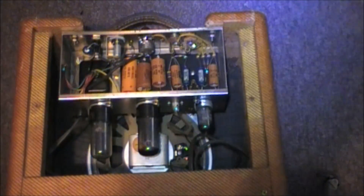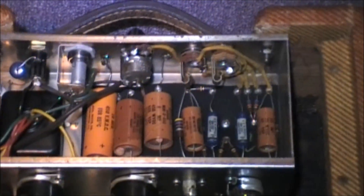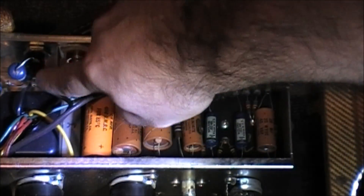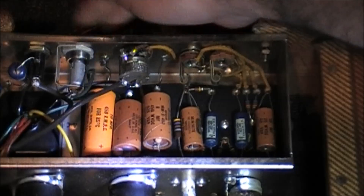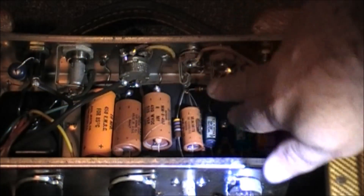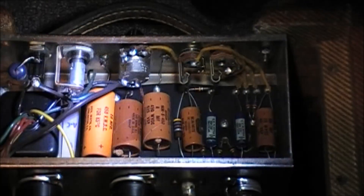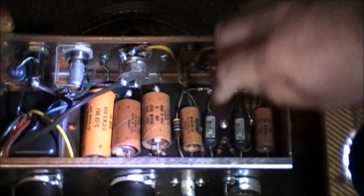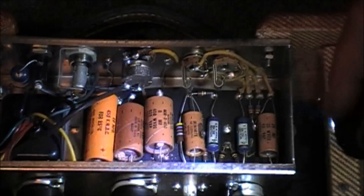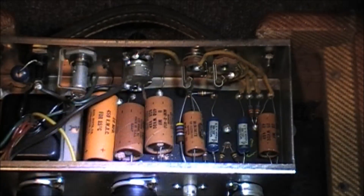I just want to draw some attention to — let me try to zoom in on the actual electronics of the day. This is 1950s electronics. What you're looking at here is the fuse holder. This is the light bulb unit here that tells you if it's on or off. And this is your volume button here, and your two inputs which are right here. And you're looking at some very old capacitors — and surprisingly they look pretty good. I'm not so sure about the stuff sticking out of these two. I don't know if that's leaking or — it looks like a bit of dirt or something coming out of those caps. So it's possible it may need to be recapped.